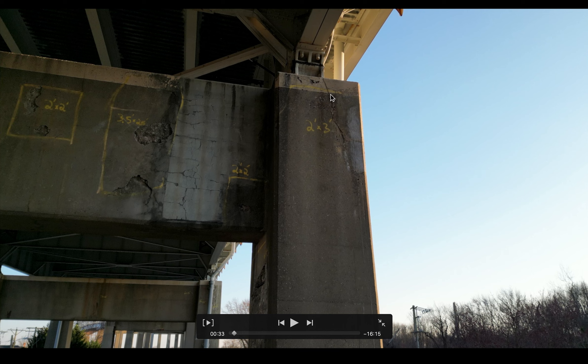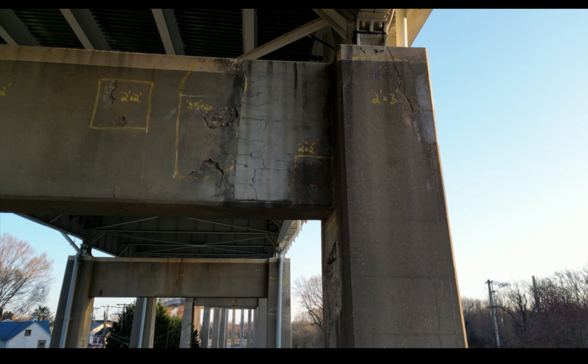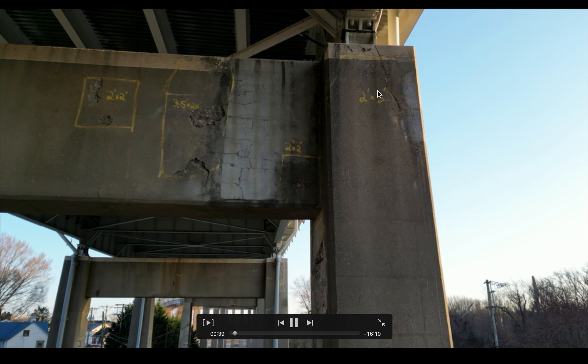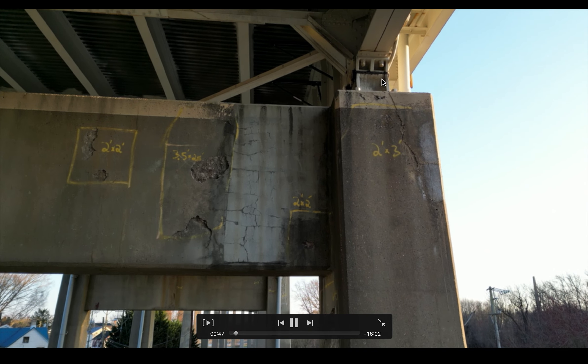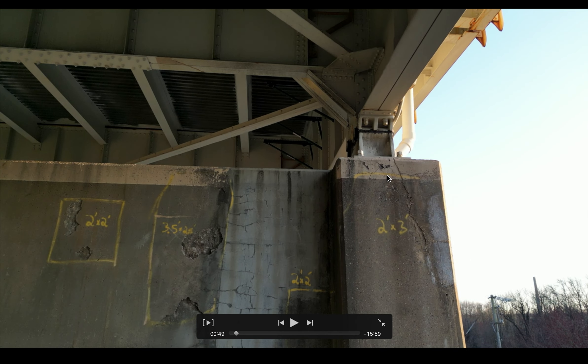So it looks like we have some strain here that's able to fracture or stress these stirrups out. I don't see a lot of water damage or efflorescence there, but it's continuous — on each one of these sections, the same issue. So when they rebuild this, will they address this? It's doomed to happen again. You see it also coming this way at the top surface where it's not backed by this tie beam. They're putting $45 million into this, and unless they resolve the load transfer into the top of this column, this will happen again.